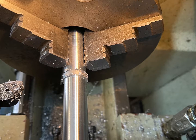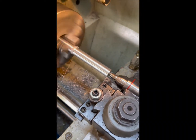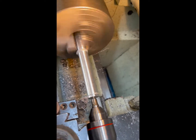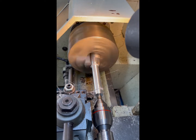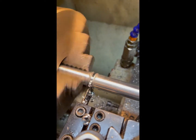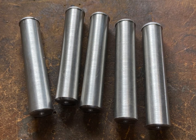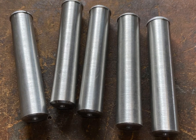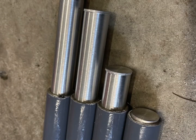So the first job was to try and do something about that. With a little bit of metalwork, I got onto the lathe and made a bit of a job out of it. You can see we've got some 20mm stock steel, and we used the lathe to turn that down and leave a little lip on the end. Here's the parting-off process, and of course I had to make six of those because we've got six poles. You can see the six finished pins — they're about 19 millimeters in diameter and 100 millimeters long.